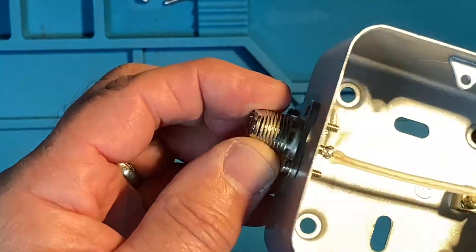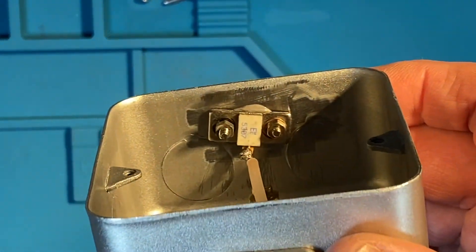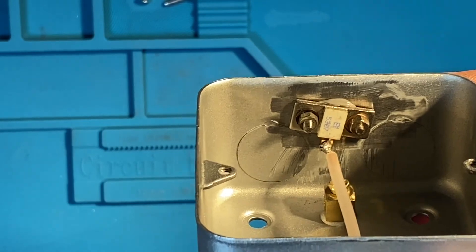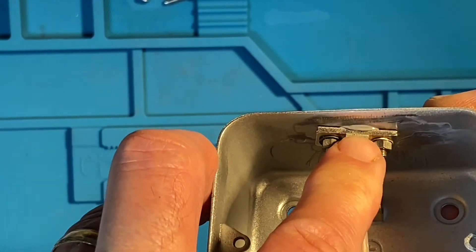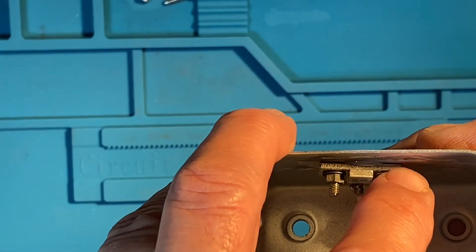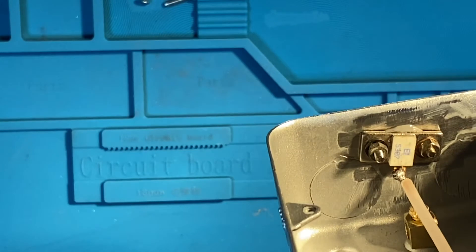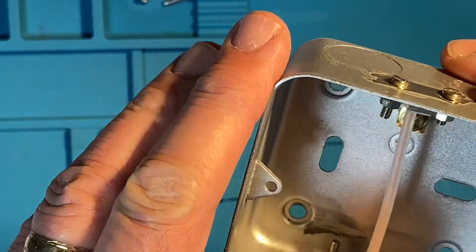Just punched that one out and drilled a couple of holes. The back eye on the resistor I just drilled that out - as you can see, really skewed width, but there you go. And then I put some thermal paste on the back there. I've got a couple of brass washers on the back, just to dig into the metal which I've sort of sanded back, so I'll get a good connection all the way through then to this part as well.